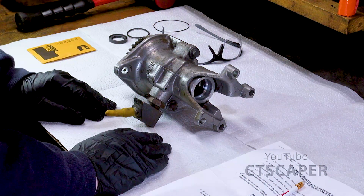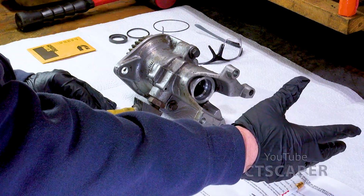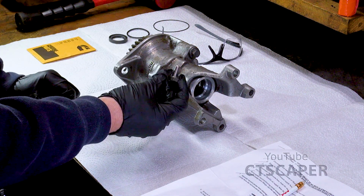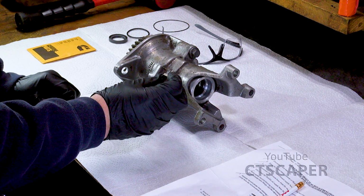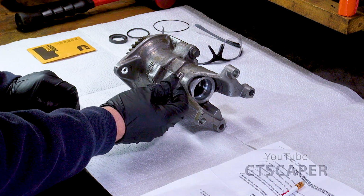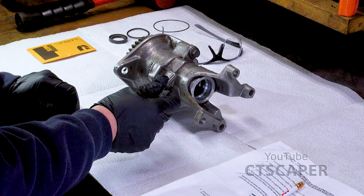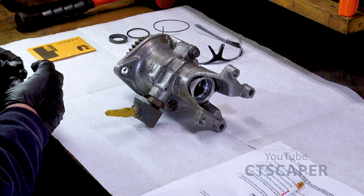Okay guys, well, it's been a couple days since I filmed the last piece of taking the power steering pump off here. I went to the hardware store yesterday and picked up some stainless. This is an M10 by 1.5 bolt, but it might be a little bit too long, so I might have to cut it down, which may be an issue because it's stainless, and I don't think stainless cuts very easily. But I got two of these to plug where those two green caps were in the power steering pump.